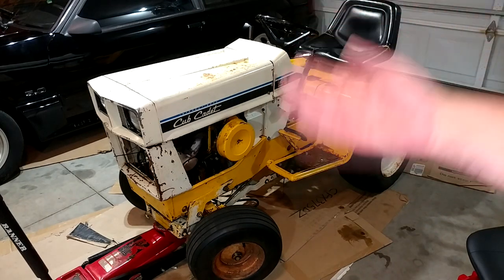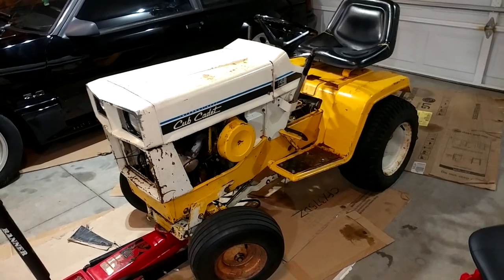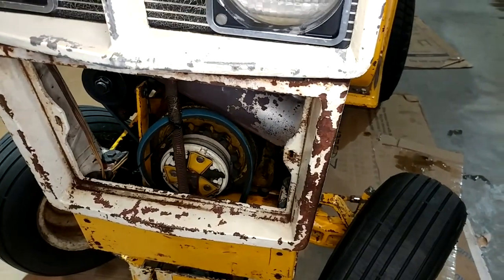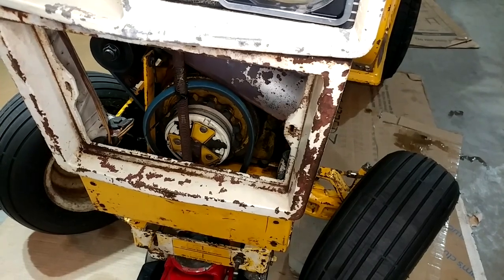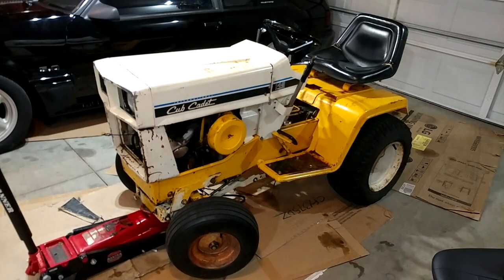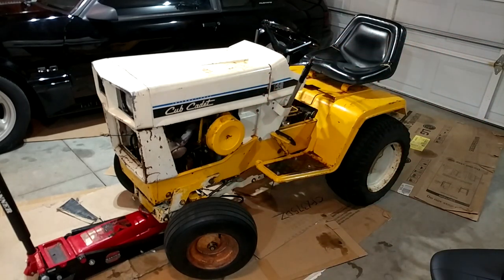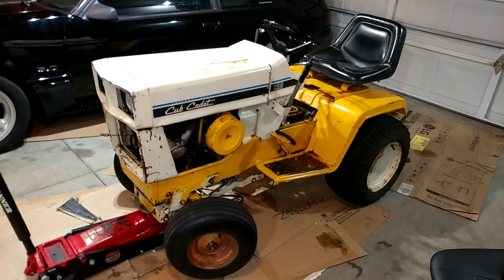I like to change the oil in the spring. Usually I'll try and let the gas that was in it from the fall run all the way out at the first mow of the spring, so that kind of takes care of itself. The only other thing I'll mention — just so I don't have to keep track of it and it stays out of trouble — I like to zip tie the PTO belt up to that spring right there. I'm not sure that spring is a factory Cub Cadet thing, but mine has one, so that's what I do with it. It keeps the belt out of the pulley if I need to run it in the winter and also keeps it from falling off the tractor. So I'm going to get the thing greased and shove it back into its hole. If you need to know how to grease or service one, I have a video in the playlist where I do all the annual maintenance — it's about an hour long and time-stamped so you can look at each thing individually. It's been a really good year and I'm pretty happy that it was. For you guys who like the tractor content, it's probably going to be a little bit of a drought until spring, but I promise there will always be more Cub Cadet content on this channel — we've got way too many of these things for there not to be. Thanks for stopping in and we'll catch you on the next one.